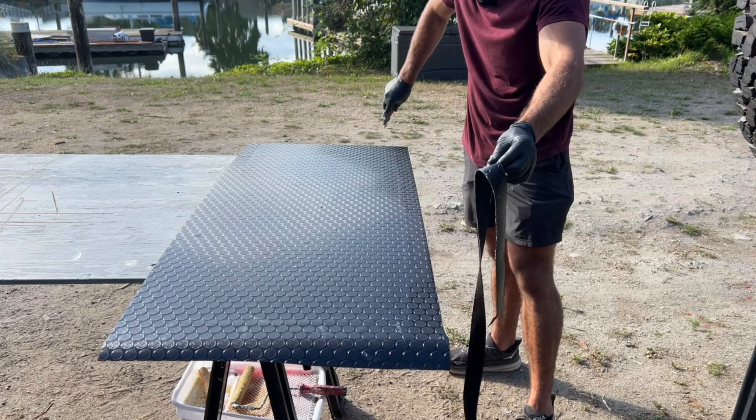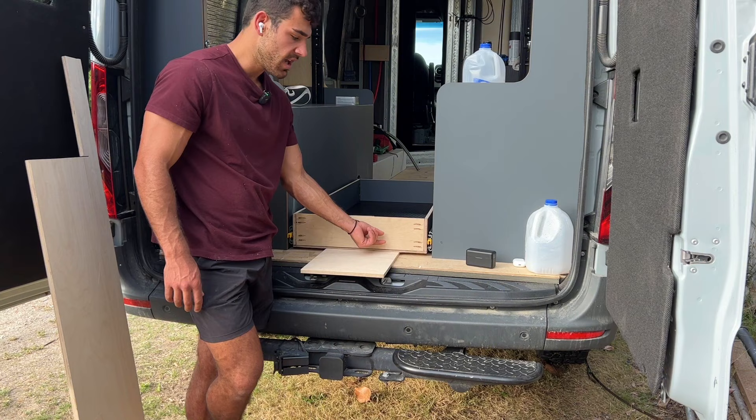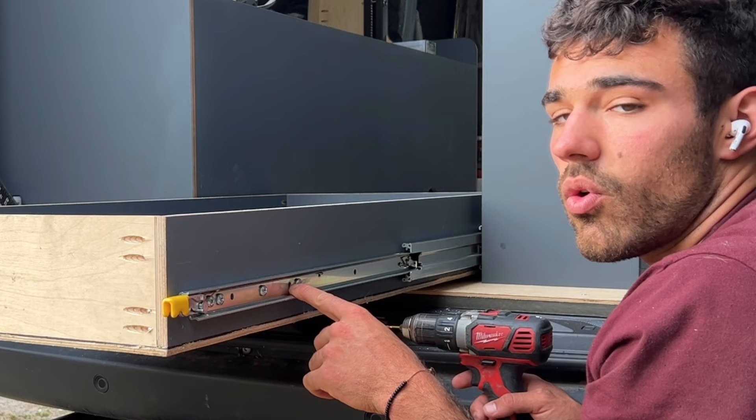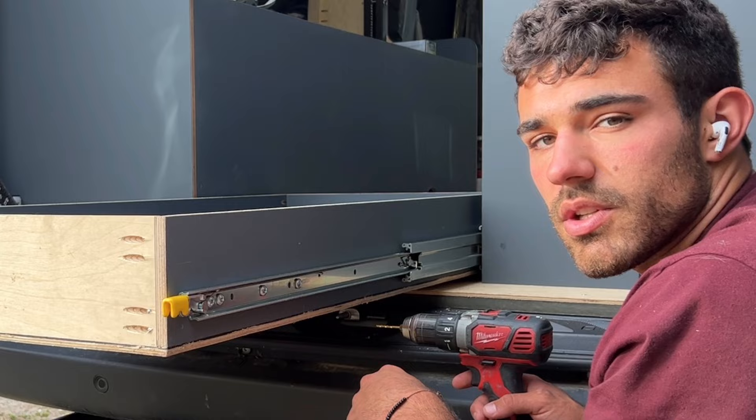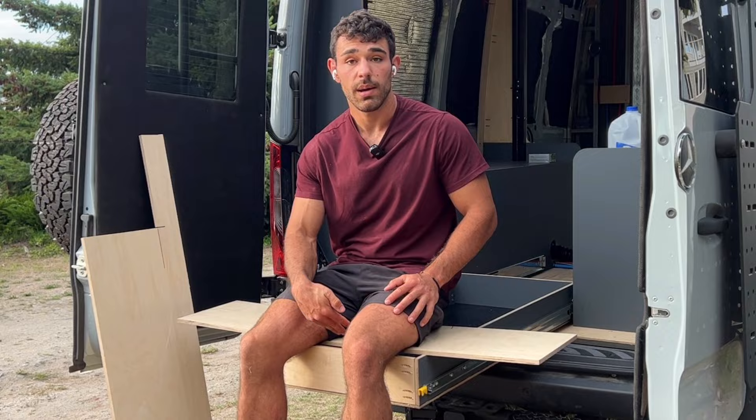I spaced this up with half an inch because there's gonna be a quarter-inch floor right here and I need a quarter-inch of play for the drawer to slide. I'm pre-drilling because I'm using number 14 screws, which is the size of this hole. So if I misplace the start of this screw, it's gonna pull the hinge in a bunch of different directions. I'm gonna strength test this right now — 500-pound drawer slides. Keep in mind I'm at the very end with all that leverage.